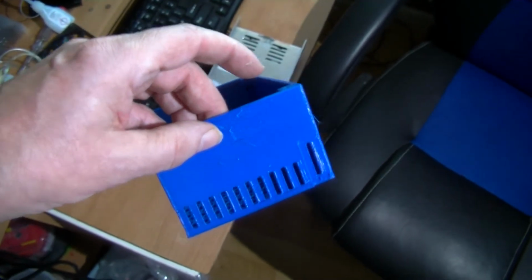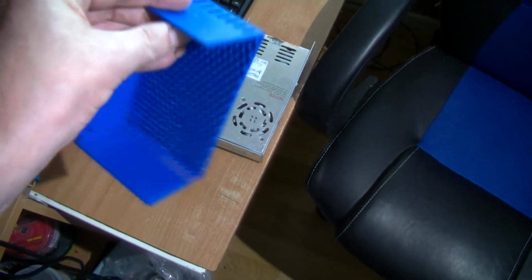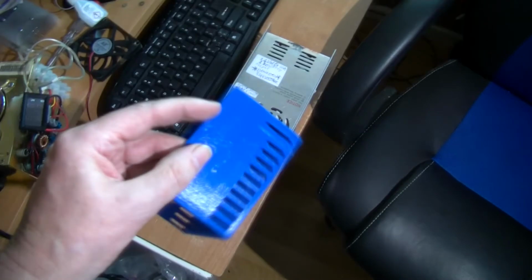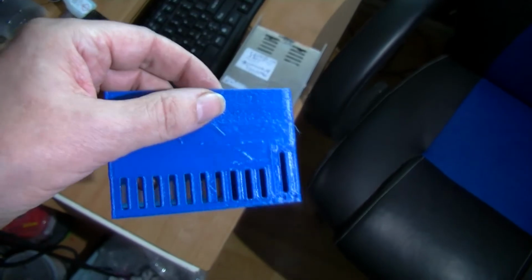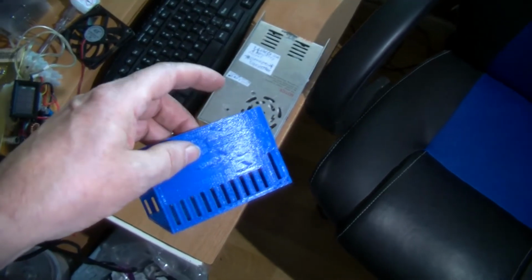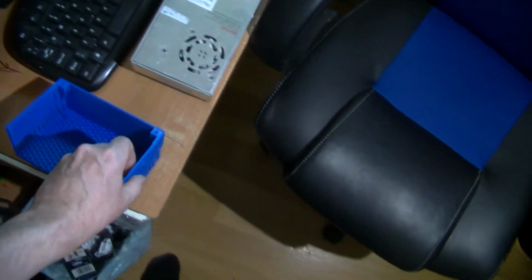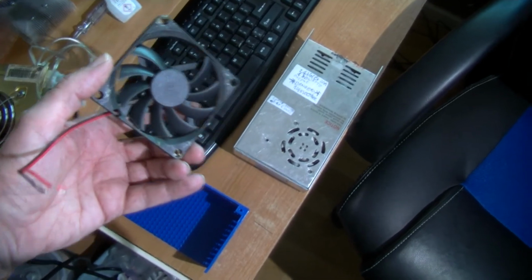Anybody know anything about that on the FL Sun QQS Delta printer? It's not major. I am doing 100 millimeters per second, 0.3 layer height. I tried it on one at 70, a similar model, well, a different model to this, but the same corner was causing the same problems. And believe it or not, I was experimenting with this fan, and I've lost two blades off it.